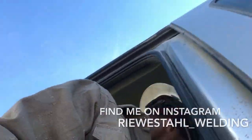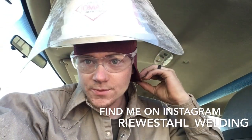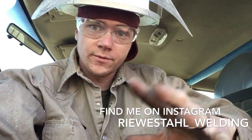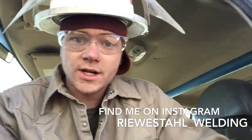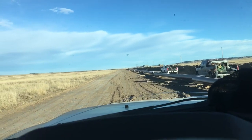Hey everybody, we're over here in Colorado and we're running a small crew to do some mainline section that we skipped. We laid a few people off. I'm still here, a couple people are still here. So we're buffing bevels with the welding trucks, and our helpers are going around doing that. We've got three welders going through buffing bevels, and I'll show you guys how Luke is buffing.